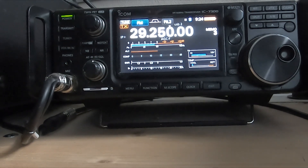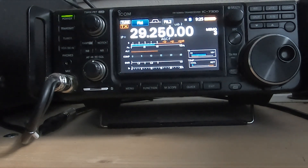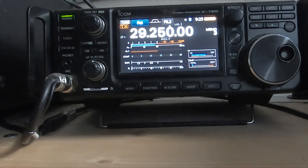So we can see a very nice modification. In my situation it helps me a lot, because I can now put my 40 metre dipole and tune it into the 6 metre band and the 4 metre band. So that helps me really quite well. I think it's a really good modification at this sort of high SWR, even with the AT tuner. I also have a new aerial - an all-bander, the HF360, which maybe we can have a quick look at. I don't have the radials yet, but I wanted the wider AT tuner so I wouldn't have to buy an external one to get the HF360 in all the bands to resonate.